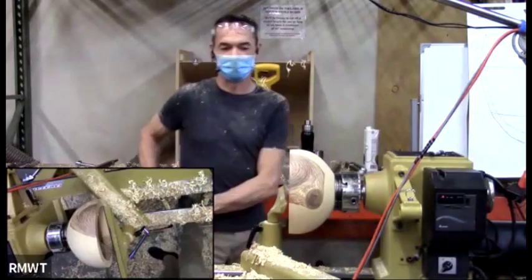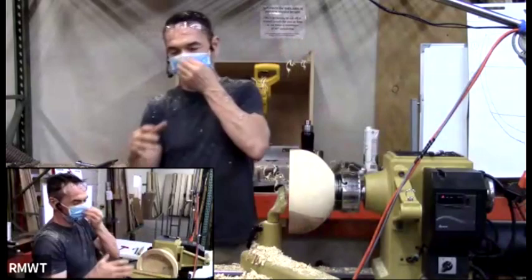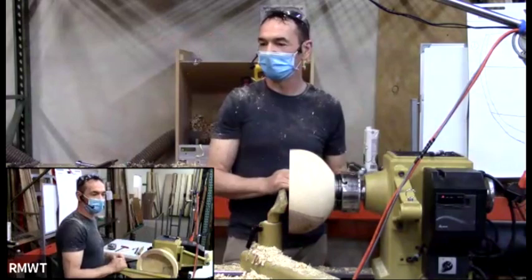So right at this stage, I would definitely wax or glue this. I'm going to start using the Elmer's glue 50-50, which is Elmer's regular wood glue diluted with 50% water. It's better than the paraffin wax ones, like the Anchorseal. It flexes a little bit with the wood as it warps, whereas the Anchorseal doesn't. And I have a friend that's been using it for about 2 years. He says he's never lost a bowl using the Elmer's glue and 50% water. And it's pretty cheap.